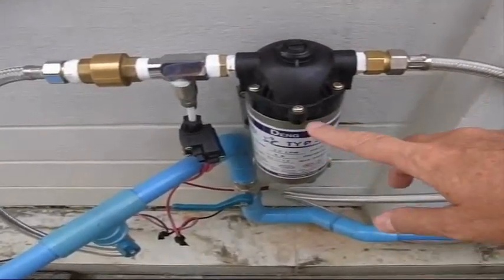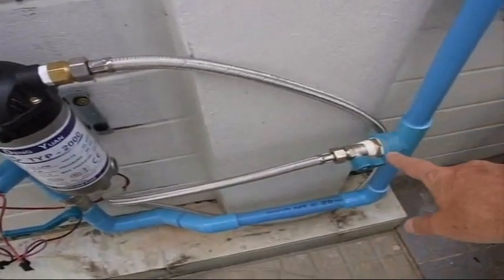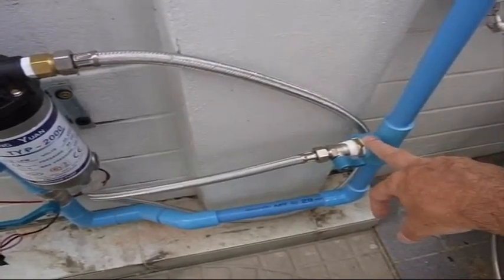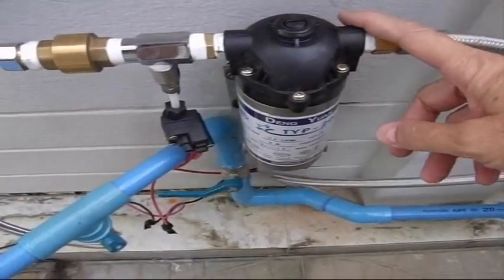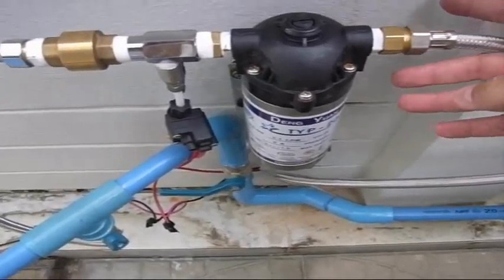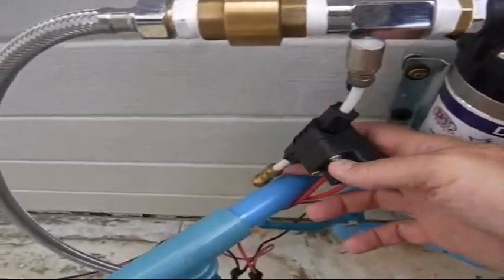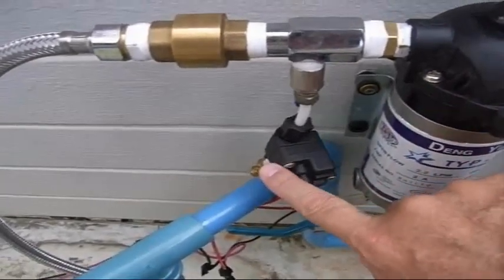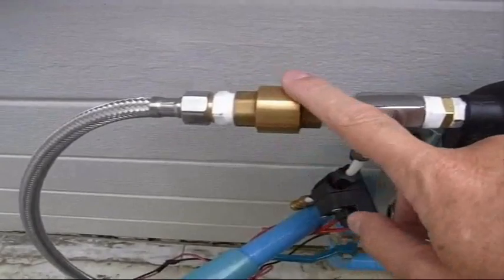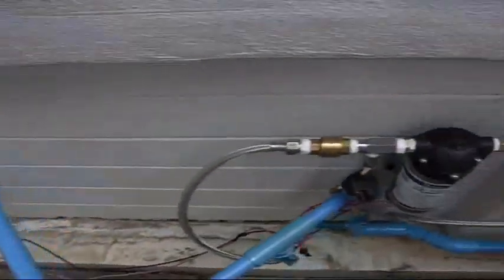There's not much to it. It's a 24 volt pump, 2 liters a minute, which is a very miniscule amount. It's hooked over here from the city intake, and there's a sand filter back in there. It runs down here and comes through the pump — it's a diaphragm pump. Typical working pressure is about 80 PSI and it's capable of 130 PSI, which is a lot. That's one of the reasons I have a pressure cutoff switch on here. This is all out of one of those reverse osmosis systems. The pump is wired through the switch — it's got a fuse in there, a one-way valve to keep water from backing up through it, and then it goes back into the house.